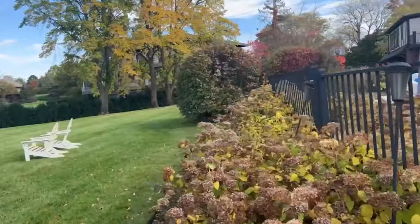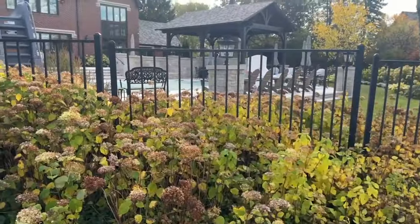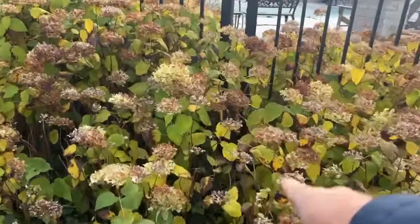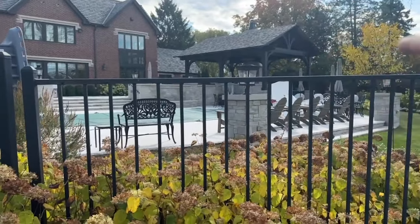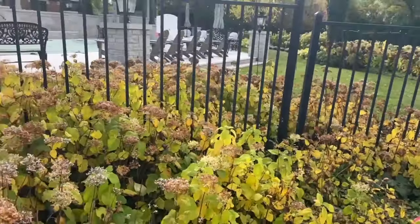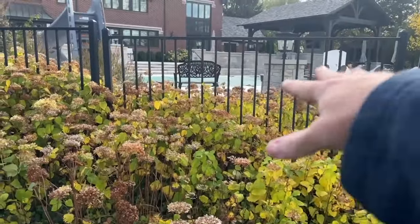This is super important. We can take out whatever fence panels we want, but you've got a box here and a box there. So let's take out this fence. You can see how none of them are actually hooked together. So I think we can just kind of dig around the footings and pull this thing out. Do not strap the center of this and try to pull it out in the center. You will 100% bend that. Still strap it down towards the base of these poles down in there, and it'll come out without any disruption. If we bend something, I'd rather bend it down in there than up in here. So that comes out, we can crawl right through here.